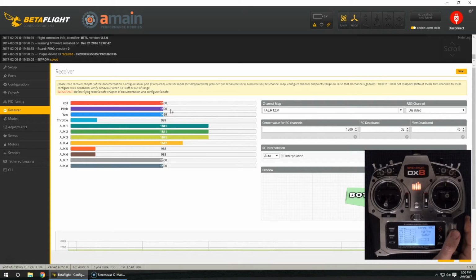I'm also going to adjust the rudder. It's blatantly off. It's a small number, but nevertheless, it is off. We do want it to be biased towards 1500. And we can see here it's going back and forth from 1500 to 1501, whereas before it was arguably rock solid at 1499. You could leave it at 0. You could leave it at 1. I'm going to leave it at 1.